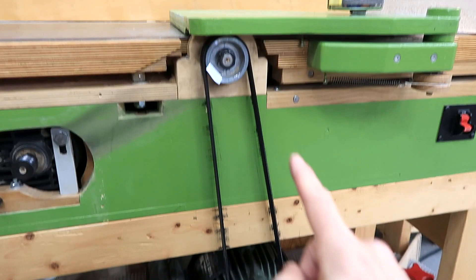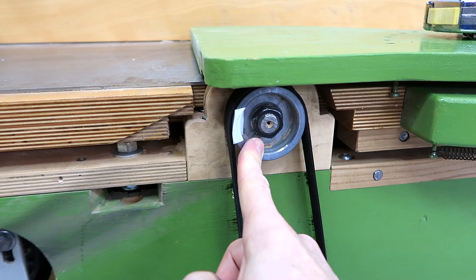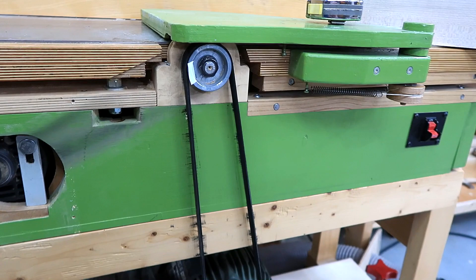With this pulley and this pulley, I'm only getting a step up of two to one, which means this is only running at about 3,500 RPM, whereas with this motor it runs about 9,000 RPM, and I do think I have to run this much faster. So what I need is a much bigger pulley that is better for this type of belt - maybe twice that size.